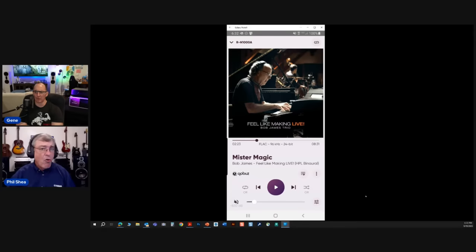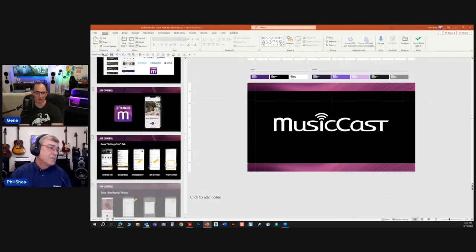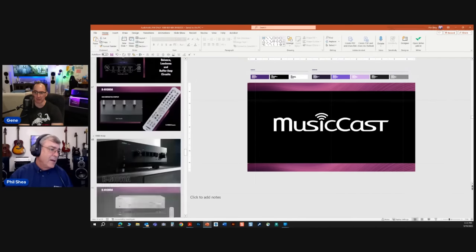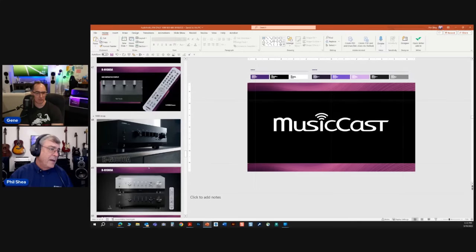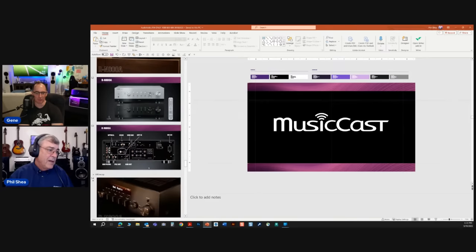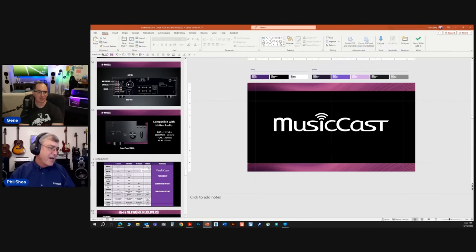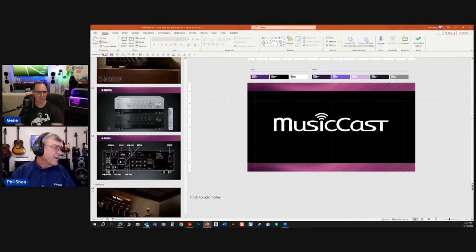We do want to address the press releases you sent. It was weird because of the way you spec'd power on the 600. All the other models are spec'd at 8 ohms and 6 ohms, but for some reason you spec'd the 600, the lowest end model, at 4 ohms, and the power was less at 4 ohms than at 8. Right away that triggered my thought that you must have the impedance switch set low. Yes. I recommend never setting it low, but I know you have to meet a UL requirement for heat dissipation, and it's there for that. And in the specs I have here, we don't have all that stuff in there.